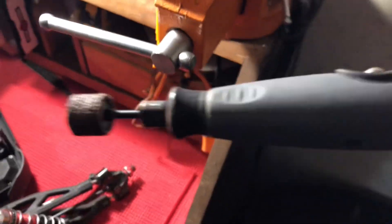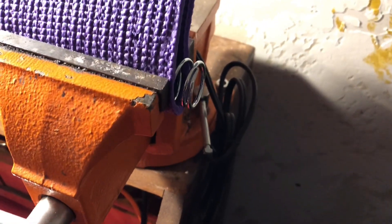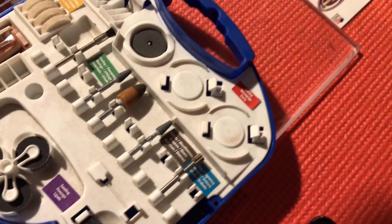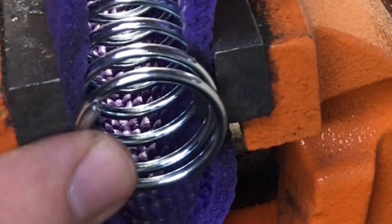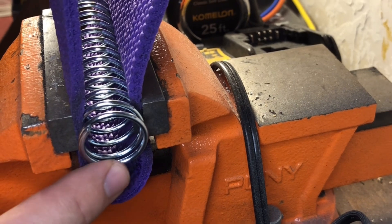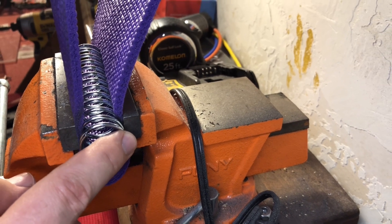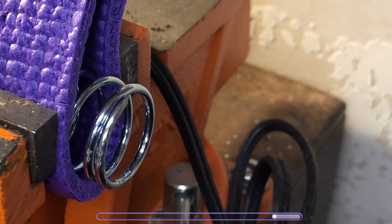The reason it's really easy to use one of these sanding discs is because they have such a wide surface that you can just make quick work of it. If you tried to dremel this down using something narrower, it would be messy, uneven — you'd probably have bumps everywhere and it would take forever. Focus more attention on the section from about nine o'clock to six o'clock, take off more there, then take off less and less as you get around. You can see it starting to flatten out right there.